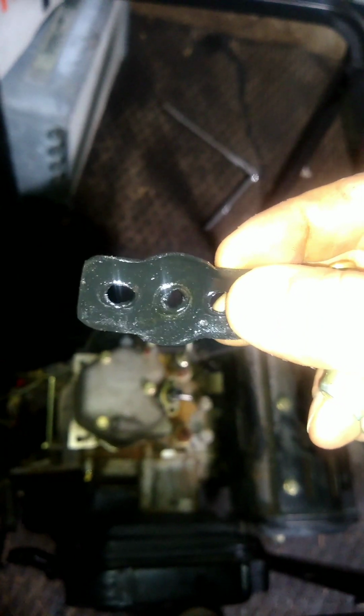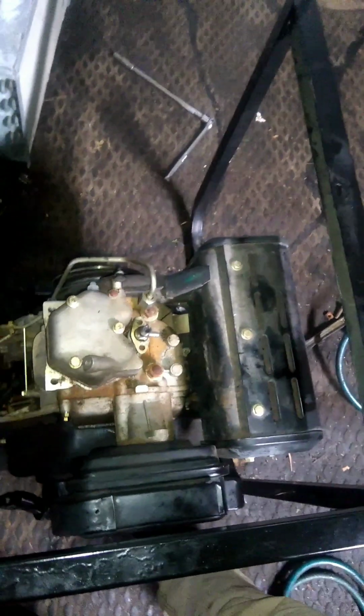So things shut down on me. I went in to check the fuel filter, and lo and behold, the original problem was this thing. The one problem that kept it from starting when I bought it showed right back up. This petcock had a little piece of rubber down in there because the petcock gasket had swelled over the years. Like I said, 2006, it swelled a little bit. So I just poked something up in there and got some flow. So I got fuel flow, and everything was fine for months. And then all of a sudden, a little piece of rubber I poked out found its way back into the hole in that petcock. So yeah, it acted like a clogged fuel filter, but it was actually just a clogged petcock. So there was nothing else going on here.